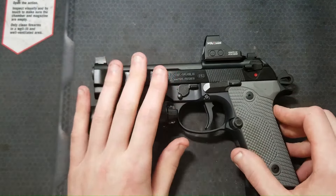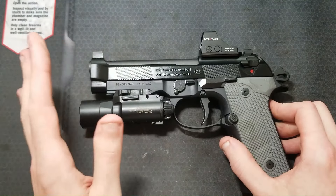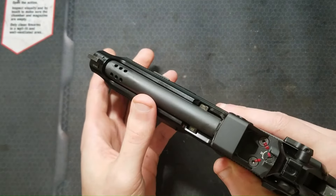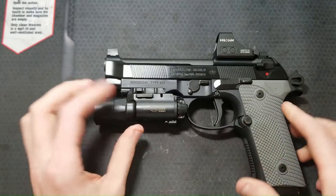I will note that I did have to remove the locking block from the barrel assembly to get it clamped in my vice prior to machining. And then after machining and deburring the holes, I just refinished the barrel with cold blue as it's just carbon steel. As always, I will include a muzzle flip comparison before and after porting.